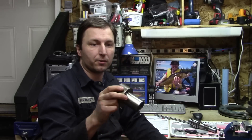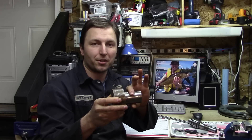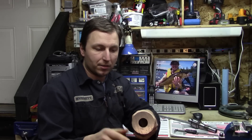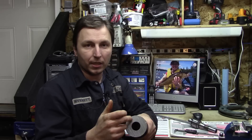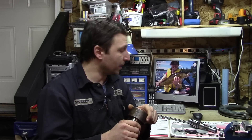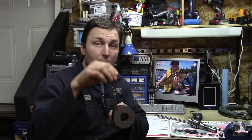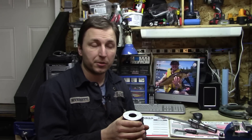I have a piece of scrap metal here that was basically given to me. I'm not entirely sure what it was from, it's just a cut off. The nice thing about it is it's actually got a shoulder. So I'm going to grab onto that shoulder, face it, machine it — and it's already got the hole started in the middle. It's about eight thou large, which gives me just enough to clean up the outside surface to make it three inches. I'll clean up the inside bore diameter and then start making the shoulder. When that's cleaned up, I'll take it out, cut this nub off, and face it down to width. Once we're done that, I'll probably make the handles while the lathe is still running, then go over to the mill. I'll need to put holes 180 degrees apart — one is a through hole with a thread down to a shoulder, and the other side is a blind hole with a thread. Threads are 3/8x24, and I actually do have a 3/8x24 bottoming tap, so that'll be handy.